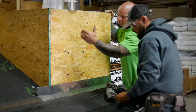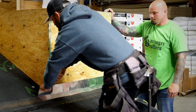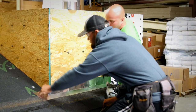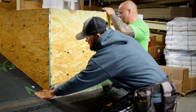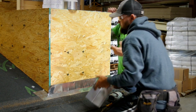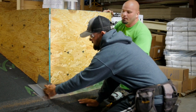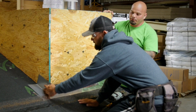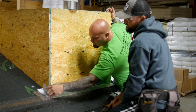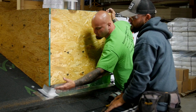Next, you take your outside wall as your line and cut straight down. What this is doing is creating something for your step flashing to drain off of — you'll have your corner, and the step flashing will have something to drain off of too. This pretty much eliminates the void down there. You might have a pinhole you touch up later with caulk. Pre-vents are fine, but then you've got this big jumbo piece you've got to try and get out — it's a headache for the siders and a headache for us.